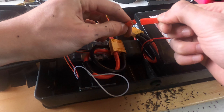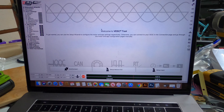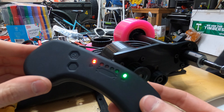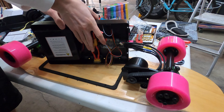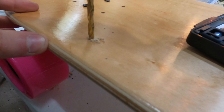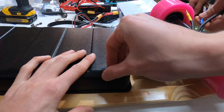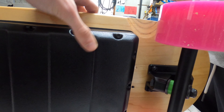You can then connect the two 2-pin JST connectors. With everything mounted in place, we used VESC Tool 2.03 to connect to our VESC and program it — this is a crucial step, and we'll have a tutorial linked in the top right corner on how to program your VESC. To test that everything works, we turned on the remote, turned on the board, checked if it paired, and if the motor spins you're good to go and can seal up the enclosure. By this point we had already mounted both sets of trucks to the deck, and all that was left was to make the holes for the enclosure to be mounted to the deck. To do this we used threaded nut inserts — we drilled a hole the diameter of the insert through the deck, then drilled the nut insert into the deck so that a screw could go through the enclosure into the nut insert with no visible nuts anywhere. We repeated the process three more times so there was a bolt in all four corners of the enclosure.